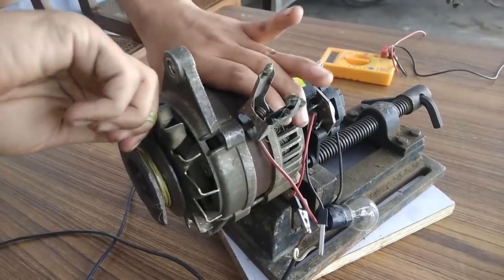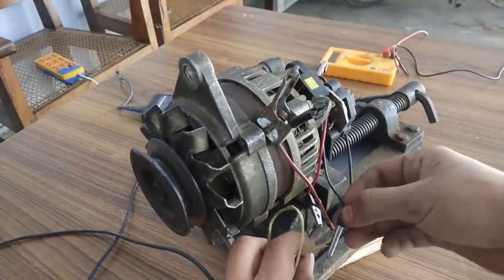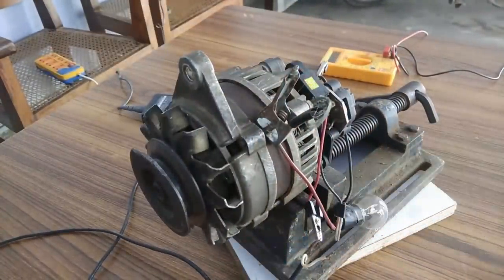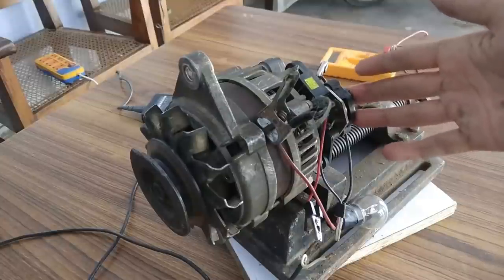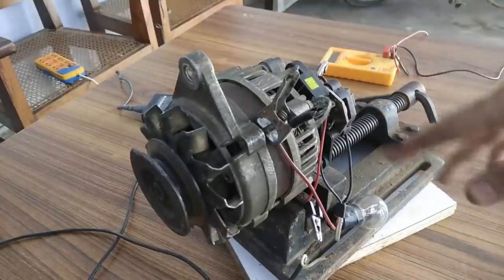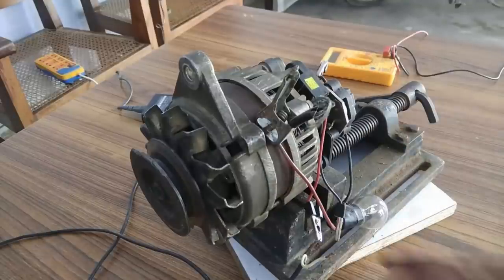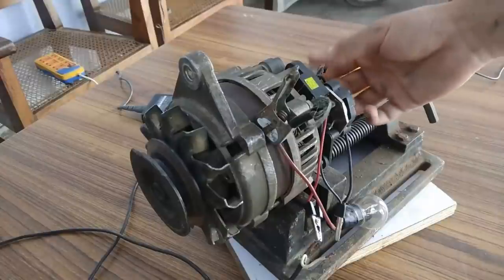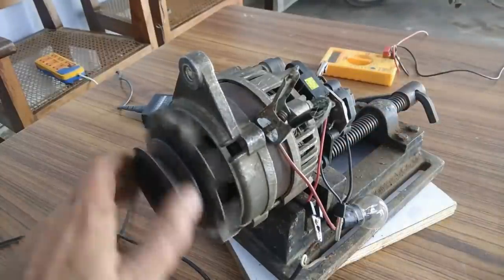Okay, go. So guys, as you can see, the alternator is working perfectly now. All I had to do, if your voltage regulator has stopped working or there is some issue with it, was connect the brushes directly and take two wires out to feed electricity from an external source and generate electricity out from the output terminals of the alternator, and it should work fine.